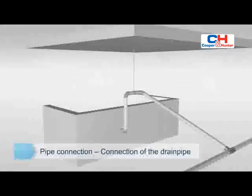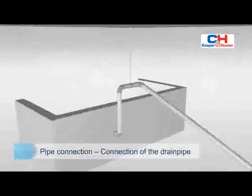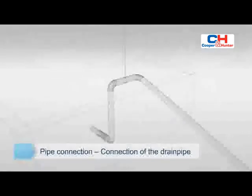If the outlet of the drain pipe is higher than the body's pump joint, it is required to provide a lift pipe for the exhaust outlet of the indoor unit, and the distance of the lift pipe must be 12 inches or below. Taking the bottom of the water pan as the datum plane, the lifting height should be less than 30 inches. Otherwise, the water will overflow when the air conditioner stops.